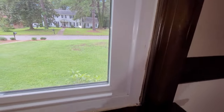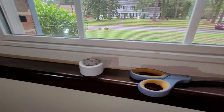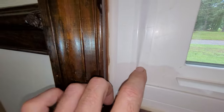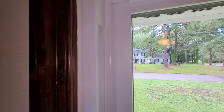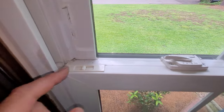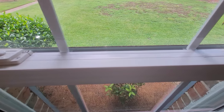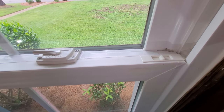I did not do the bottom here — the bottom seal on the window was still good — so I did up the sides. You can see I missed a little spot, but as we go up it matches perfectly, it doesn't look bad, and it really helps seal the windows from the cold, the heat, and any kind of draft in the winter. I've also done the top and in between the window locks. I can guarantee nobody that comes into your house will notice except for you.